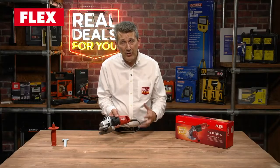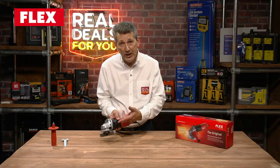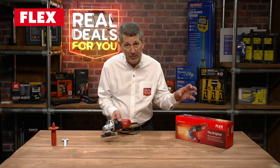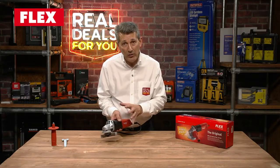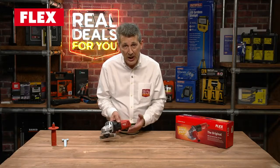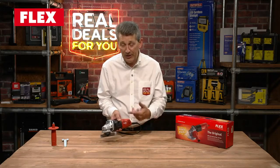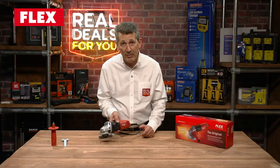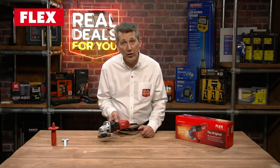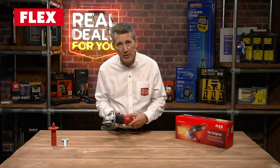Also with Flex grinders you have the power safe mode as well. If you were working and the cable came out and you went to plug the cable in, it won't turn itself back on. It's got a fail-safe in there as well, so you have to disengage the switch and then switch it back on again before it will restart. So that's a great little safety feature, because if somebody did happen to kick your cable out or whatever, or you had a power cut and you went over to do that, the angle grinder is not going to run off down the road. So that's a really nice safety feature, super little product.